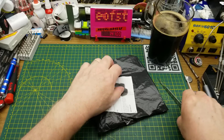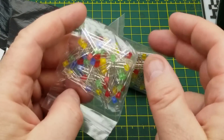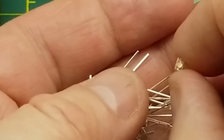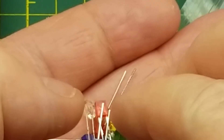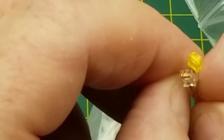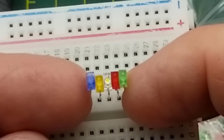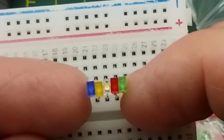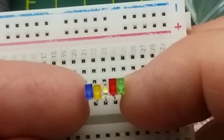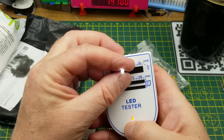This next package says integrated circuit — yep, yep, yep. Oh, that's not ICs, that's a bunch of colored LEDs. These are not your common LEDs; these ones are rectangular LEDs. They're good for putting together if you want a really tight bar graph kind of display. They fit tighter than standard holes in a breadboard, and if you want to make some sort of bar graph display, they're really cool. You could also put them together linearly to make straight line displays, arrow displays, or things like that.